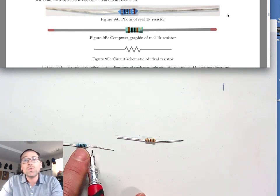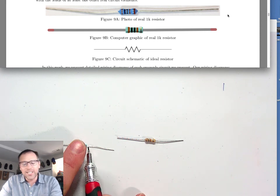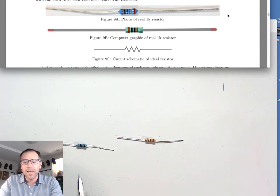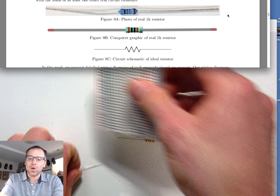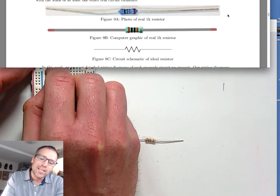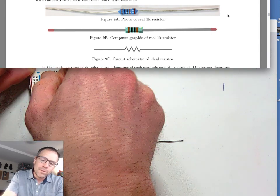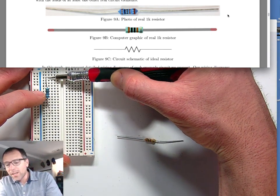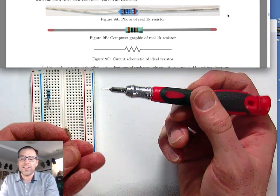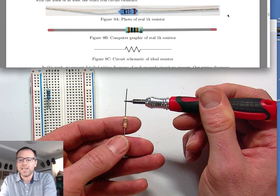And then we're going to call this a two-terminal element. Two-terminal means two places that it connects to other things. This is one terminal, so the wire sticking out of one end, we're going to call that one terminal. You can also call these leads, L-E-A-D-S, leads. So this is the first lead, and then this is the second lead. So those leads are the actual physical wires that allow us to connect the resistor to other circuit components. So what I do is I actually take this lead and I stick it into the little contact strips that we saw in the last video. And then once I've done that, the body of the resistor sits here, the lead connects to that contact strip, and then that extends that lead, that physical conductor, out over here, and the same thing's true on that side. And so we can think about every two-terminal element, and we'll start with resistors, as wire, the actual functional part, wire. Another way to say this is lead, body, lead.